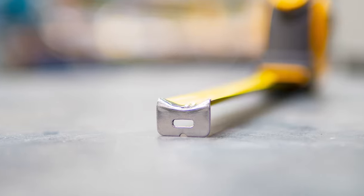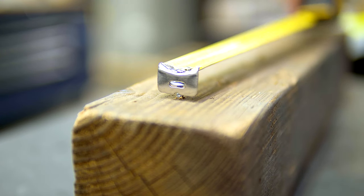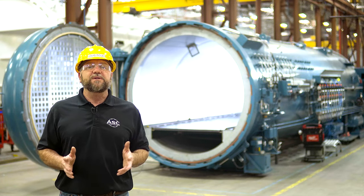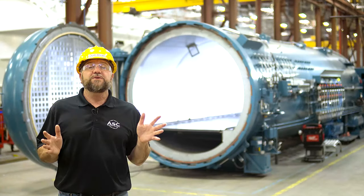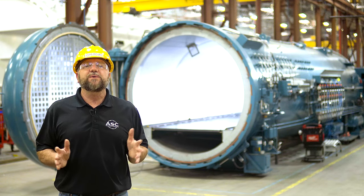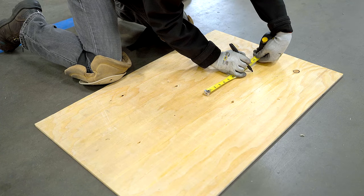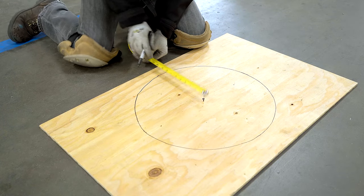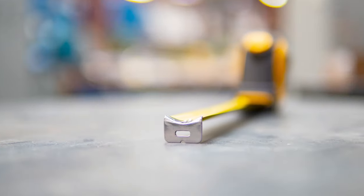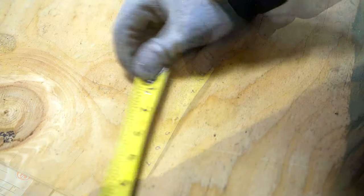Another feature on the hook is the slotted end, or nail grab. This rectangular opening is designed to latch onto nails or screws. If you are working by yourself and need something to hold the end of the tape, you can add a nail to the material and use it to hold the hook. You can also use it to make half or full circles just like you would with a compass — attach the hook to the nail, extend your tape measure to the desired radius, lock it in position, then hold a pencil to the material as you revolve around the nail to trace a measured circle. The edge of the hook is also notched or serrated so that you can mark material if you don't have a pencil — just push it back and forth to leave a mark.